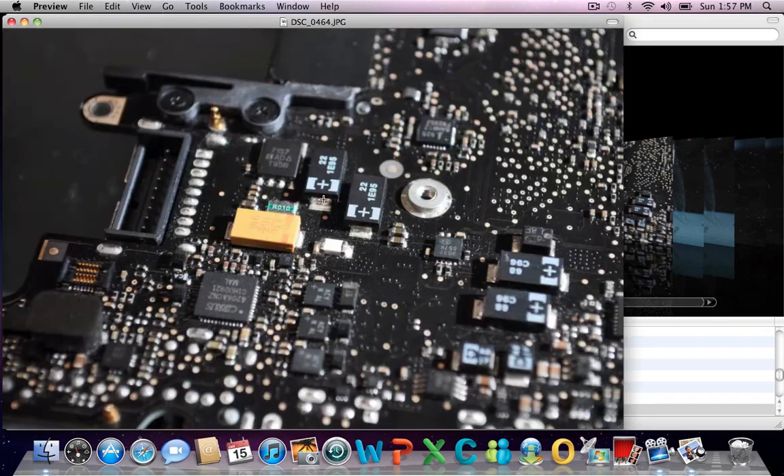That fuse is right here. This fuse actually supplies power to the battery. We have another QFP package here, and this is actually for a Cirrus Logic chipset. You have this power and this QFP over here that does the same thing as the other one. Power comes across here, goes to the battery, and vice versa. As it's coming out of the battery, this protects the rest of the board — that fuse right there performing the same basic function as the other ones.